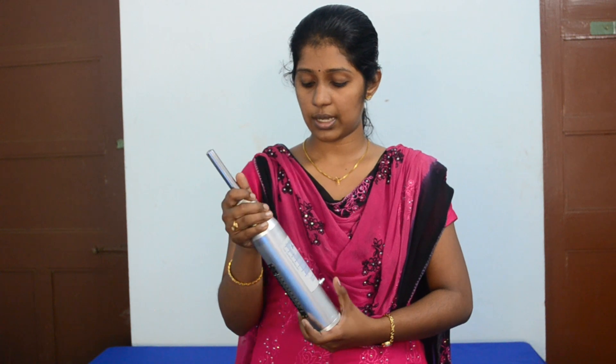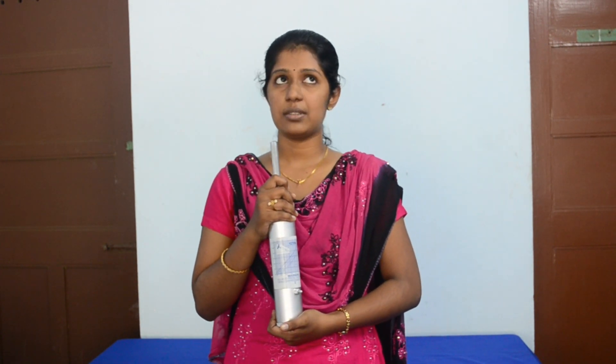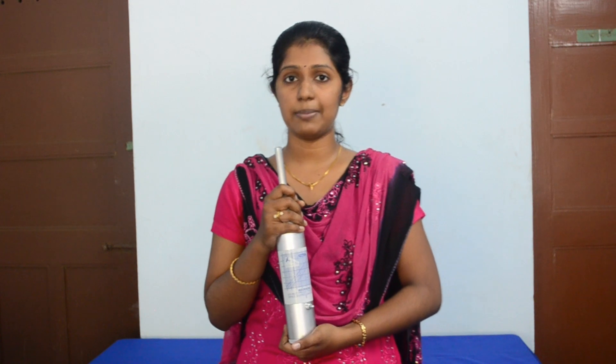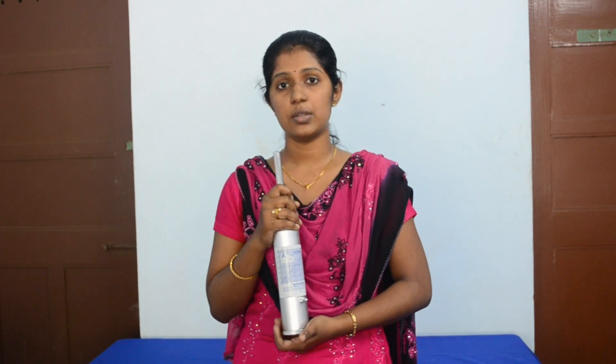This test is very simple and easy to perform either in the laboratory or at the work site. At the same time it has some limitations. This test can only be done on smooth surfaces. Also, the values can be affected by the age of the specimen, rigidity of the specimen, carbonation, and other factors like moisture content, type of cement, and type of aggregate. All these factors should be taken into consideration while using this test for finding the hardness of concrete.